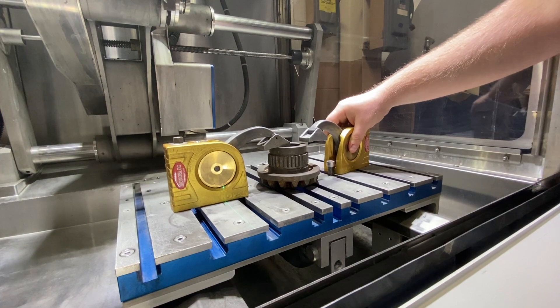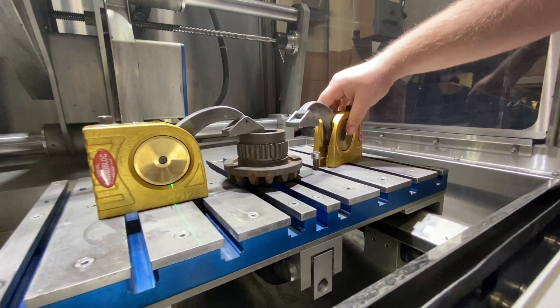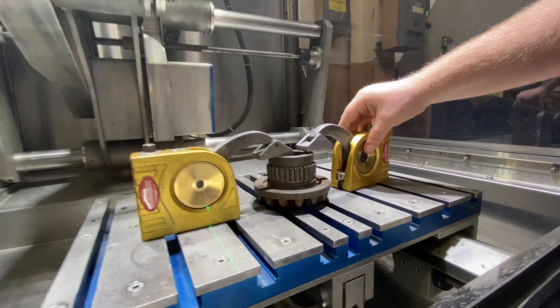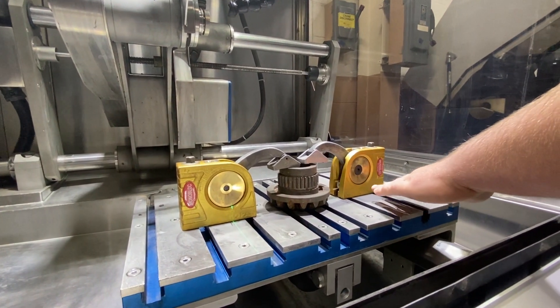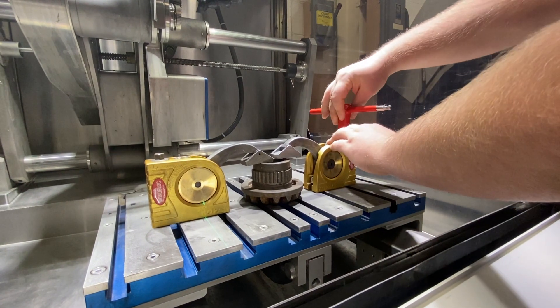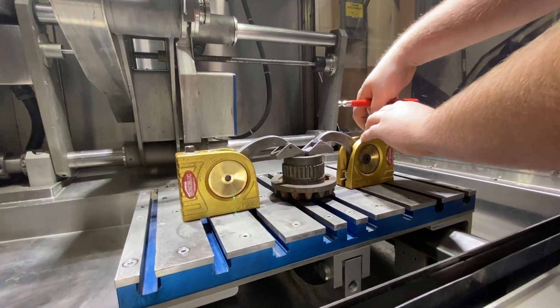It's okay if the bolt is a little bit too long to fully clamp onto the slot area of this vise — that's okay, and I'll show you what I mean in a second. With some vices, if it was flush on the top surface of the table, you would just contact the vise to the part and you'd be fine.